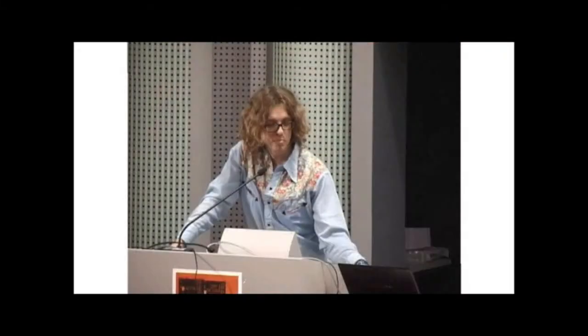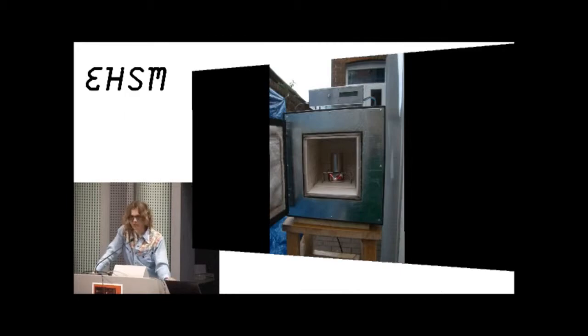The next step is to bake it in a kiln — I made this kiln out of stuff I had lying around: some high-temperature insulation, a steel framework welded together, steel plates riveted on the front, and some electronics. This heats up the flask and converts the plaster into a kind of porous, really strong ceramic that makes a great mold. The porosity is important because when you pour in the liquid metal, the air has to go somewhere — into the pores of the investment material. This takes a long time: you have to fire it for about five or six hours following a specific time-temperature profile.